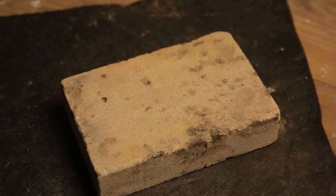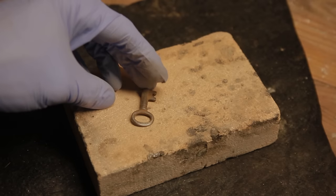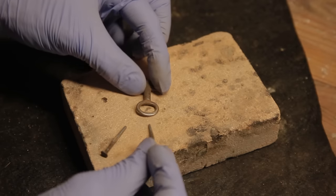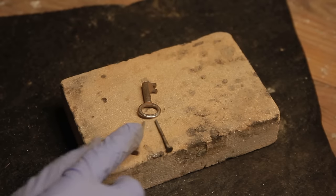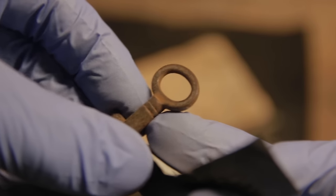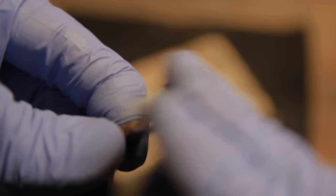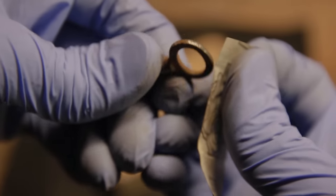I'm going to show you how I might go about making a little character. This is a vintage steel key that I got at an antique store and a couple of cut nails — antique box-cut square nails. I'm going to pretend these are going to be the legs for the character. Before soldering you want to prep your pieces. As you can see this has got a little bit of rust to it, but I'm going to sand off the areas that I'm going to be joining. You want to get it nice and clean — just take some sandpaper and get to scraping.